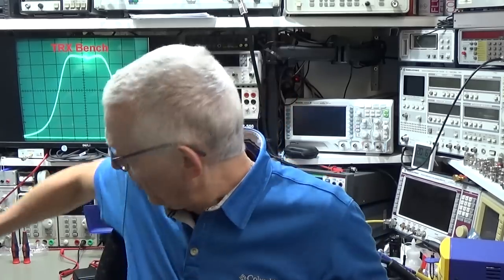And today here on the bench we have another legend. So that is this little nice radio. That is a standard C558. So that is a 70 centimeter and 2 meter dual bander. And that is from the 90s. A very nice and very good radio of quality. And the radio came in with a flashing display. So that means something is really wrong. And let's see what we can do.